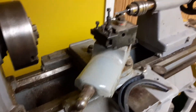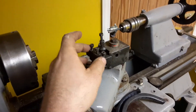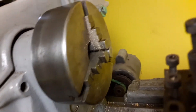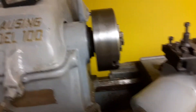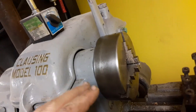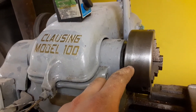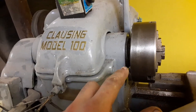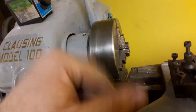I need the bigger one — I'm gonna get the one that has the two slides that come down on the handle. They call it an Aloris. And put it on there. This is a three-jaw Atlas chuck, because at some point Clausing and Atlas merged. I'm guessing this is like the beginning of that, because that is an Atlas chuck. It does have a one-and-a-quarter-eight acme thread — you just take a hammer and a piece of aluminum, tap it, and it'll screw off.